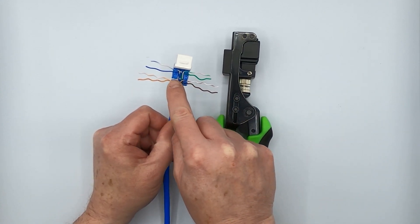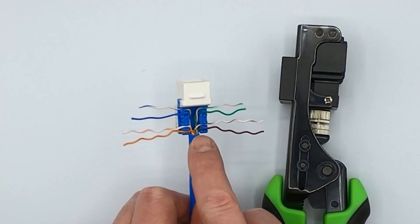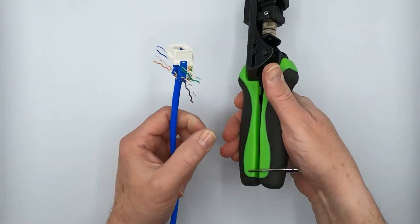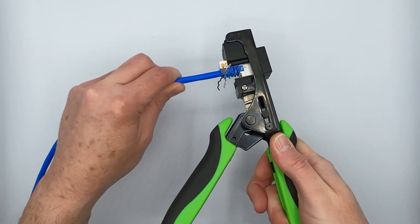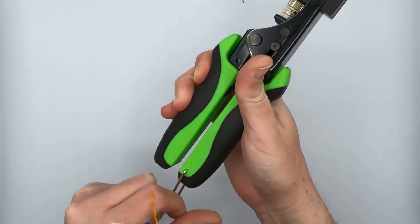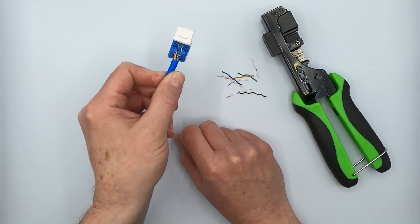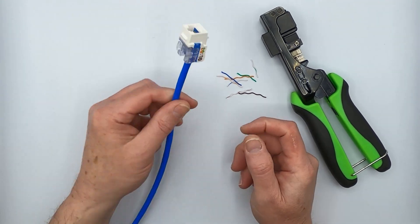Notice I've got the conductors already threaded through there. One thing to note is get your cable jacket really close up here by the end of the jack, but don't get the cable jacket inside this channel — it's going to make it very difficult for this or any other tool to seat those conductors. You just don't want that cable jacket inside the blue channel. So unlock your tool — it's all ready to go. Simply take your jack and put it in so that the RJ45 port goes in like so, with the conductors up, then close the tool. Lock it up and there will be a couple of hanging conductors, but they're cut. All eight wires have been fully seated and the conductors have been flush cut off. At this point all you have to do is stick your little cap on the jack and it's ready to put into a face plate. That simple.